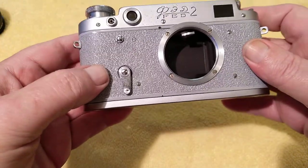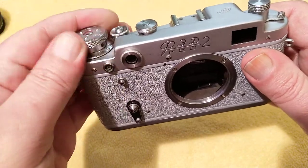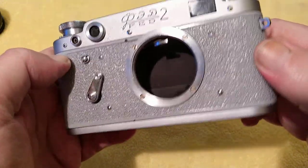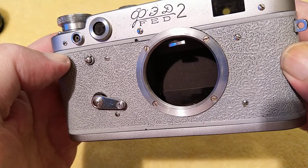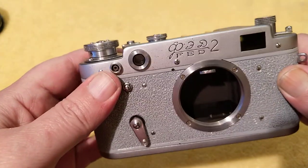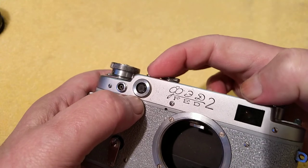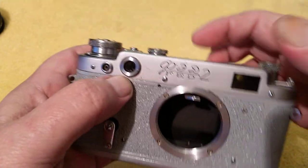This is a later version than the one I've already got — this one has the self-timer on it. So you can wind your film on, set the self-timer — there's a little arrow there — put the self-timer around and push the button. You can hear the mechanical action; it's quite loud, and it trips the shutter. You've got the rangefinder and the viewfinder windows. This is the rangefinder, this is the viewfinder. It's got quite a wide rangefinder gap here. The Leica's tends to be quite a bit closer, and this wider gap should enable more accurate focusing.